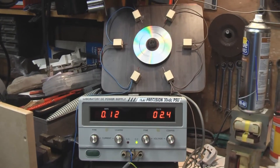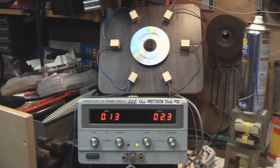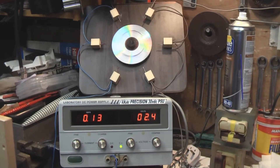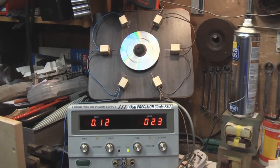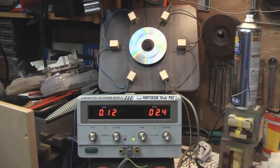I was using 6,000 volts at 0.45 milliamp from a NST neon sign transformer, but from the power supply to the Tesla coil outside my shed it was about 12 feet, and I don't think I had enough amps pushing down the cable, as well as volts, to actually make the thing work.